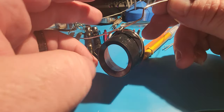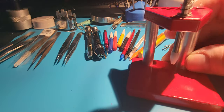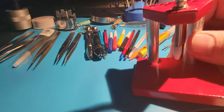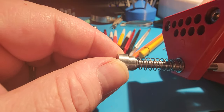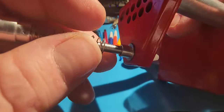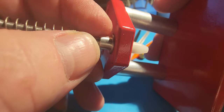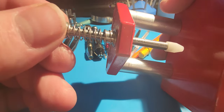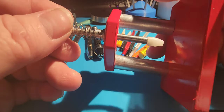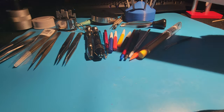I've had it come off a couple of times but it just pops right back on, so it's not that big a deal. I also picked up one of these hand pushers and ended up having to drill some cross holes in it so that it would stay on the shaft. I also have a little portable lathe and took and remade this sleeve because it was very loose — now it's still somewhat loose, but nowhere near what it was. A bit of a better tool modified to serve my purposes.